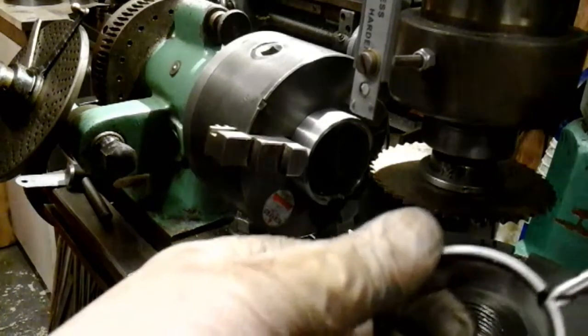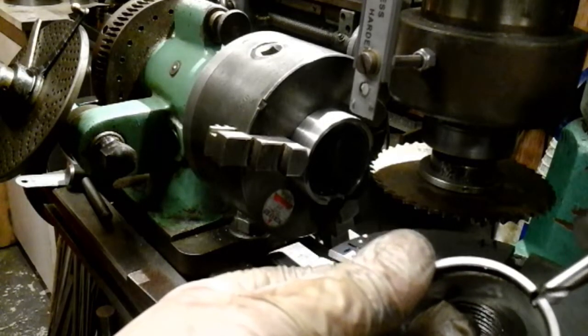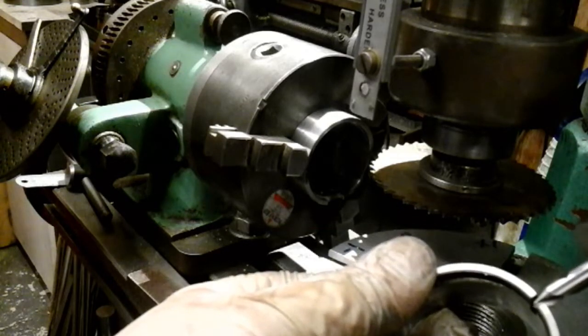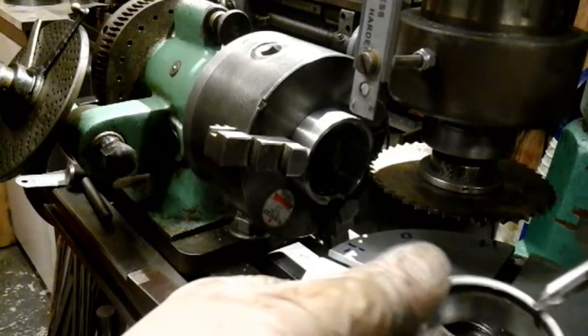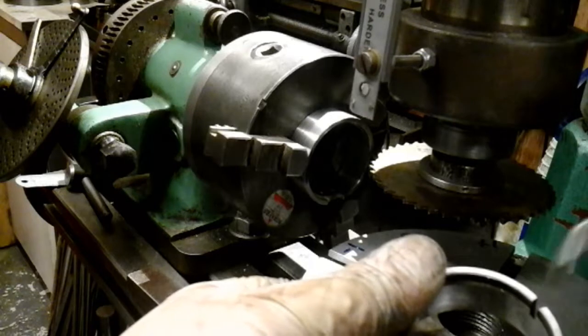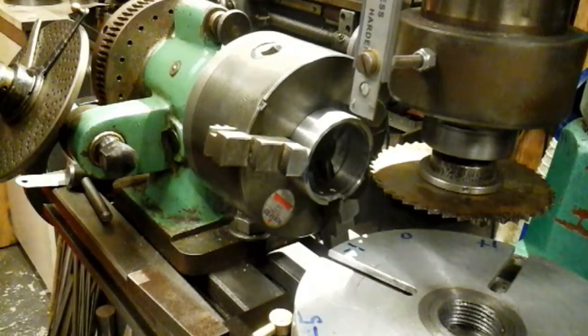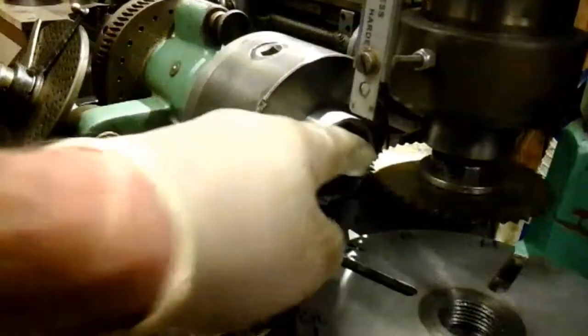It's 60 degrees inclusive — 30 degrees on each side. When I put this centre drill in to drill that angle, it'll just open that slot out the few thou that I need to make it 100 thou. I'll do this off camera because I need to move the camera to get to the machine controls. All I'm doing is putting this slot in a quarter inch deep.